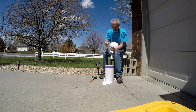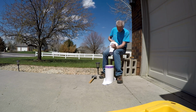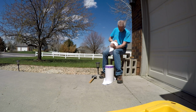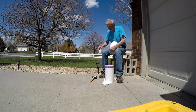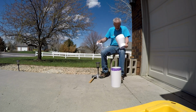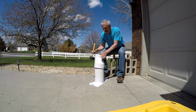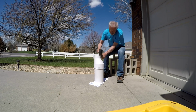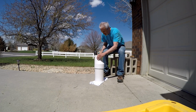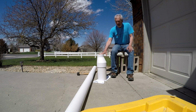Okay, my lid was stuck, so I had to break away for a little bit. But once you get your lid unstuck, you'll again see that the cement is on a little swab. So just coat the inside over the top of your primer with your cement. Get a good but thin coat on it. If any happens to spill or dribble, now's the time to wipe it down, which I did do. So let me just use my rag here for a sec. Wipe out the inside of that. And then we are ready to tap this baby down. We want a good snug fit. Pretty good.